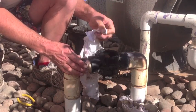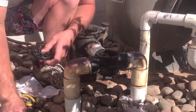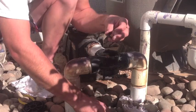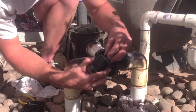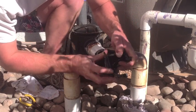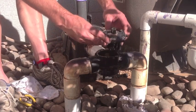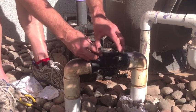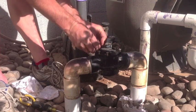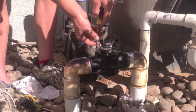Don't forget to clean all contact surfaces before installing the new o-rings. You can even apply some lube to the shaft to help it slide around in the hole a little easier. Once the top and diverter assembly are back together, place it back into the valve body. Make sure the valve stops are oriented to prevent the inlet to the pump from being closed. Replace the screws and snug them down evenly — not too tight, or the valve may sustain damage through over-tightening.